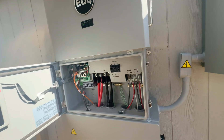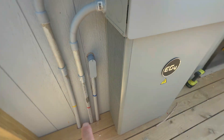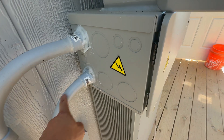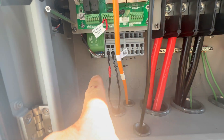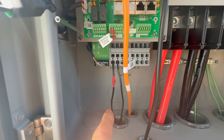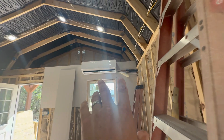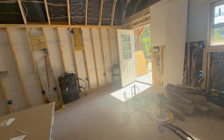So how does this work? Basically my solar panels bring in DC power, and it goes through this line right here out to my solar panels, feeds those PV wires through this conduit box, and then I feed those up into right here. There's a positive and a negative cable — I just have one string of solar panels out there, and that's what powers this entire game room, which is going to be a golf simulator, a mini split EG4 air conditioner, and a bunch of arcade games.